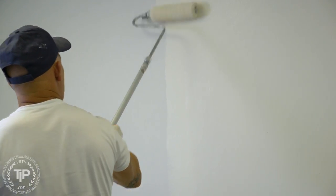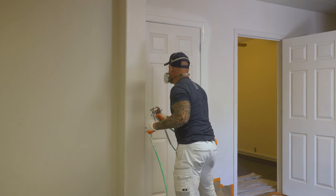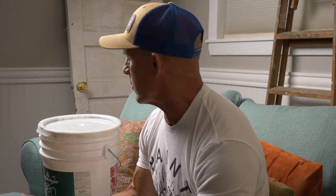Running it through a Titan Interfeed roller, I got to roll it on pre-painted walls and also on primed wallpaper — two different substrates. Over the primed wallpaper it was two coats and covered very well. There was a lot of color in the wallpaper showing through the primer, but it covered 100% in two coats. On the other walls going off-white over off-white, it almost covered in one coat. As a professional painter I typically two-coat everything, but on white over white you could almost do it in one coat. Overall, the coverage of this product definitely impressed me.